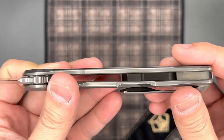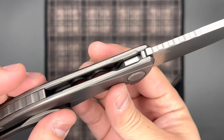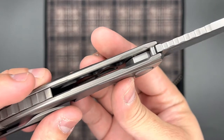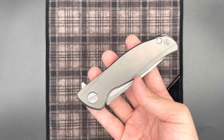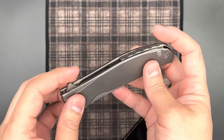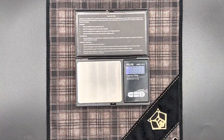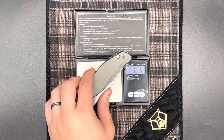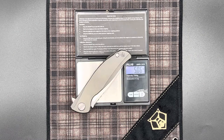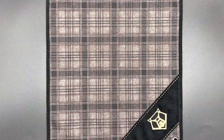The milling on the inside has not changed — we have the wave design that's done for aesthetics. I think Sergey really took some liberties there to make it look cool. The overall weight of the handle should not be much different than the F95R, but the increase probably comes from the backspacer. The F95R was weighing a little under five ounces — around 4.9 something. I expected this to be a little heavier, and indeed it comes in at 5.06 ounces. That weight increase is coming wholly from the backspacer instead of the standoff we see on the previous generation F95s.